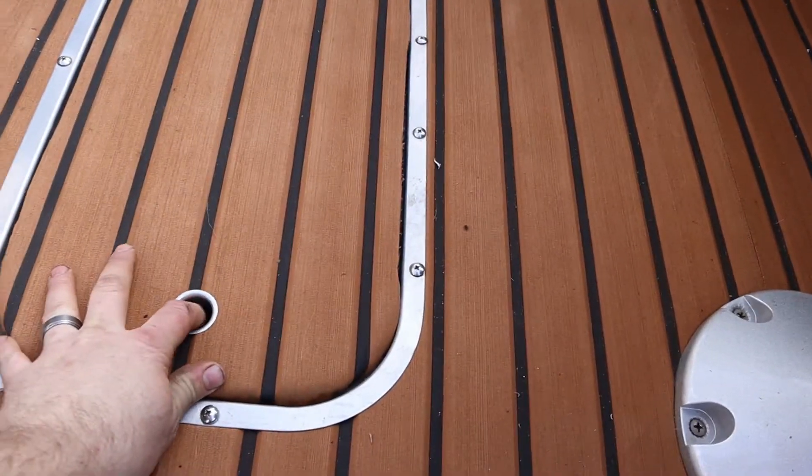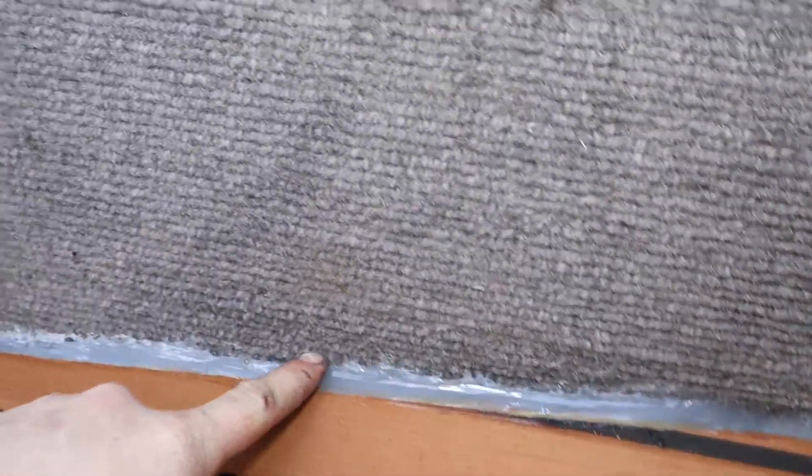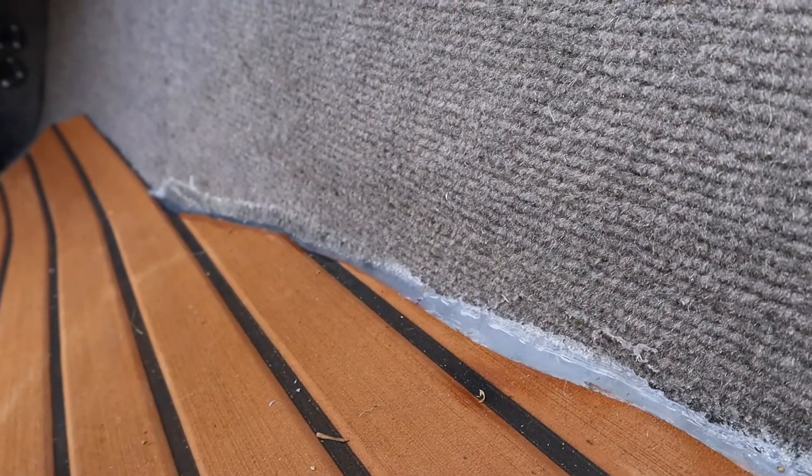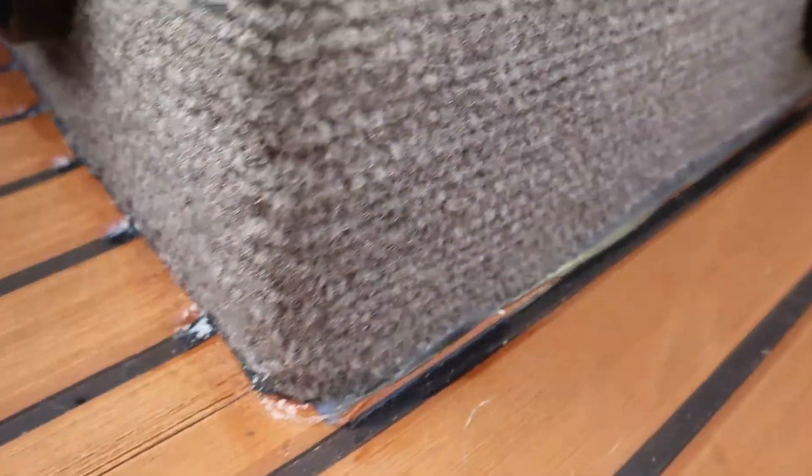One of the other things I'm not super happy about is some of the gapping that was left over when I did the floor. Some of that could have been avoided had I gone up on the edge of the hull of the boat instead of going flush with the plywood. There was a pretty large gap, and I wanted it as sealed as possible, so I filled it in with silicone. I do highly recommend going around the entire edge with silicone — it's ultimately only going to help you seal the boat up, and it helps glue the edge of the flooring down.